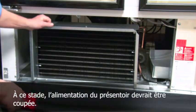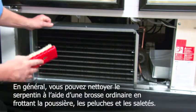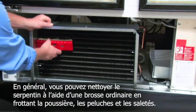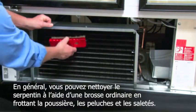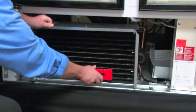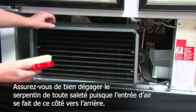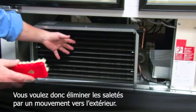Power to the case should be off at this point in time. Typically, you can do the cleaning with just an ordinary brush by rubbing the dirt, lint, and debris down and away from the coil. You want to be sure to brush the debris out away from the coil, as the intake is from this side backwards, so you want to pull the debris outward.